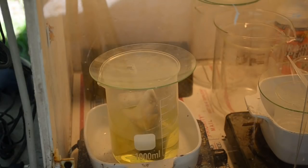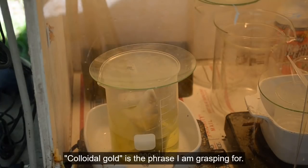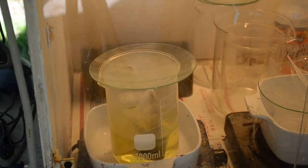It's the same process that happens with the stannous chloride test, where if you add stannous chloride to a solution with gold, you wind up with a microfine suspension, emulsion even, of gold particles. They're so microfine. And that, I think, is what is happening when we've got tin contamination. The gold just comes out of solution so fine, it doesn't want to settle, it doesn't want to agglomerate.